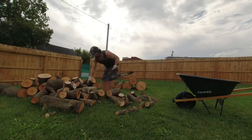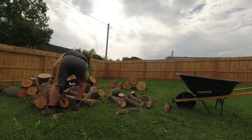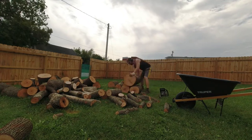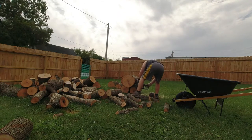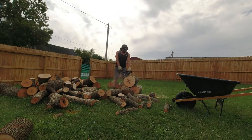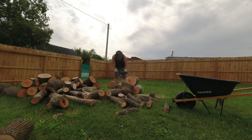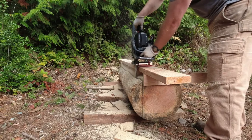I'm finishing up this video a lot later than I had planned to — life changes and I moved halfway across the country. Since I shot this video initially, I've run the chainsaw several times after that fix and I haven't once had it stall out since I shortened the chain brake spring. You can see here I'm cutting a bunch of fresh white oak and I cut it all up for firewood — just the other day — and it didn't stall out. I've done more milling, all sorts of stuff. It seems to have totally fixed the issue.